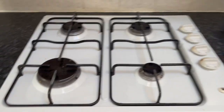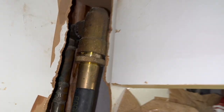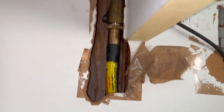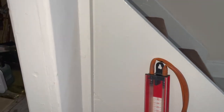For this next job we have a gas hob. The ignitions aren't working properly so they want to get it changed over. You can see they've used a cooker hose - it's a bit of a debate on this. Some companies say you can use a cooker hose on their hobs, but I think it's always best to just hard pipe it anyway. Pop the drawer out and hopefully now you can get access to these pipes. The challenge for this job is not to eat away at their cupboard any more than someone has already - I'm going to try to do all pipework behind the cupboard, not make any more holes. First thing - open the cupboard, test the gas, make sure it's all good before I touch anything.